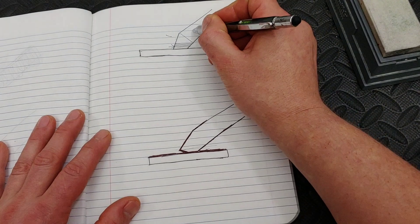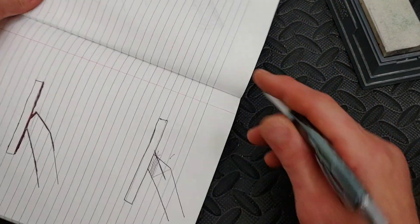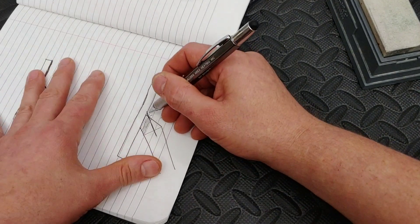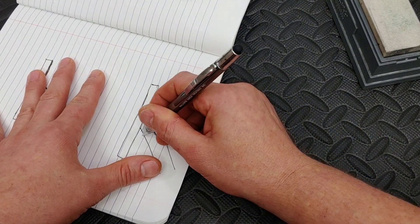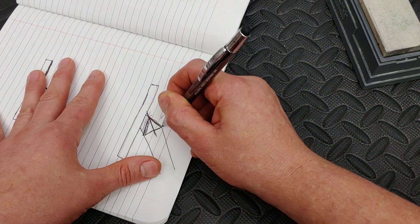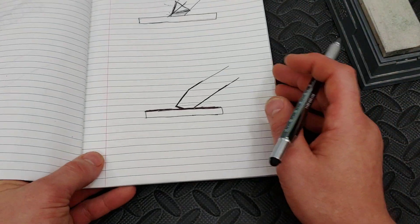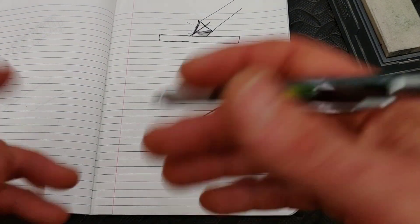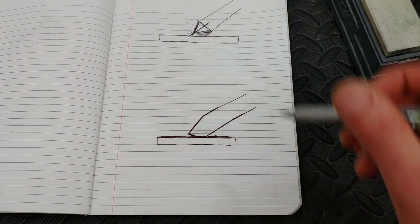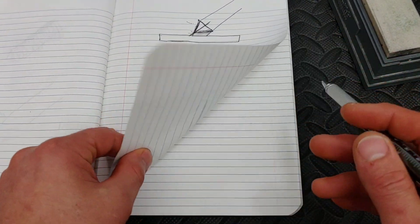You want the tip to be right down the middle — like a perfect triangle. So you're probably going to have to go back to the other side and do a little work to match it up perfectly. That way you don't wind up just changing your angle on the 17 degree side to match the 22 degree side, because it'll just create more problems. Go to the 22 degree side, do more work on that side — it'll remove steel from the 17 degree side — and then you can match it up from there.